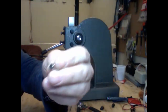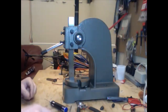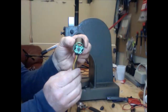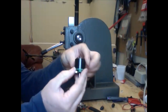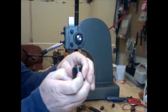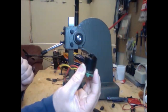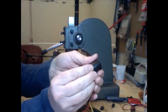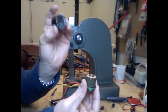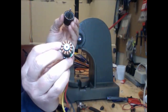I use the magnet just to hold small pieces to make it a little bit harder to lose them. Now we're going to pull the motor apart carefully. You want to pull it out straight, and you also want to make sure that you don't let it snap back together again — if it snaps back together, that's a big problem because we can damage the motor. I've got it spread a little apart, the magnets are pulling it together, and we're going to very carefully pull it apart. Now we have our can and our bottom piece with the magnets and stators.